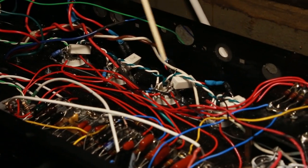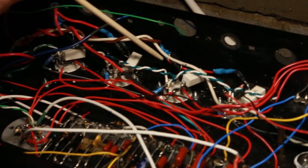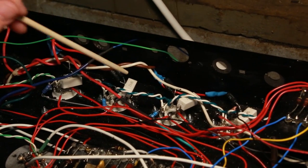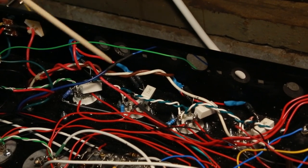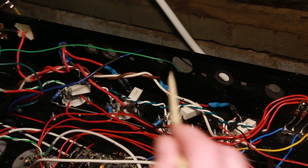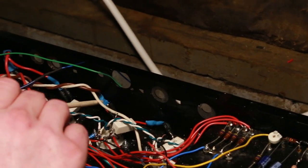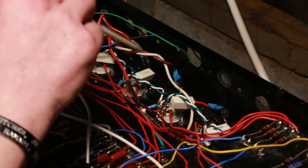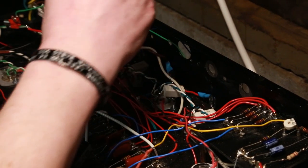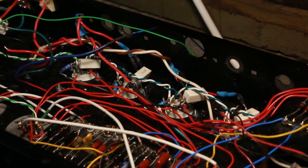All right, so I've re-soldered these. As an example, I'm taking the soldered connection of this one into the joint because it doesn't need the second set of them, but then this one takes the output from here into there as well, and then off down to the output transformer. Similar to here, I've got these wired in as well. One of the things that is generally a bad idea is having things flapping in the breeze, but since I don't have an anchor point like I have with each of these, what I've done is put some shrink wrap around those so that they can't easily ground to anything. So even though they can move a little bit, if they touch anything, they should be protected because they've got shrink wrap right up to the very end as far as I could get it. So looks like we're in shape.